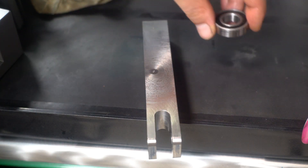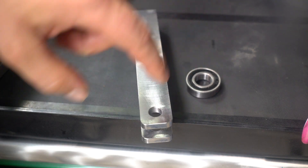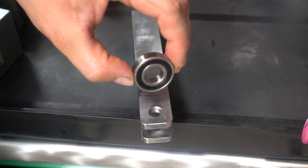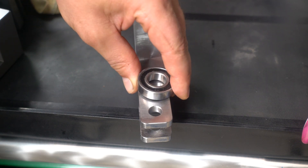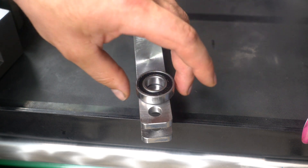This is what I've got so far — I've rounded these corners on the linear shell here. Now I just need to make a shaft that goes in here and a bushing that reduces the internal diameter of this bearing. I'm going to aim for a press fit on both so that it doesn't move when you're using this tool, but if worst comes to worst I'll just glue the shaft and the bushing in with some Loctite.